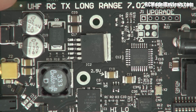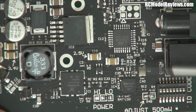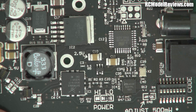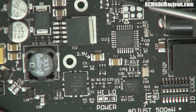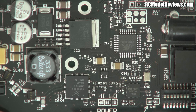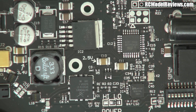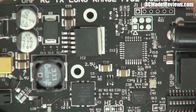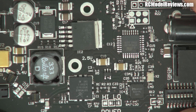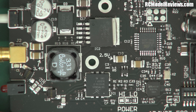The rest of the board is pretty straightforward. It's fairly well designed - a very sparse layout, not cramped in any way. The soldering is of good quality. My only dislike is it's got a black solder mask - that's the covering over the copper - so it's very hard to see where the traces go. It's a personal thing; I don't like black solder masks because it makes it harder to assess layout quality and whether it's been properly routed or done by an auto-router.